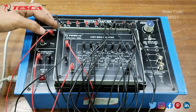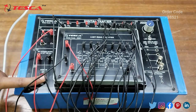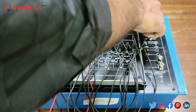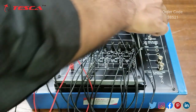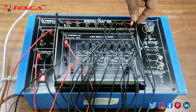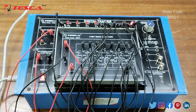We have to keep the clear switch position at 0 initially. Now we will switch on the main unit and then keep the clear switch at high position, which is 1. Now we have to provide input from the PR0 switch, so we keep the PR0 switch to the low position. On the output LED Q0 we are getting a 1 input.